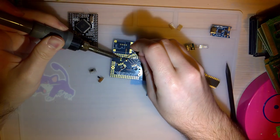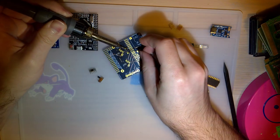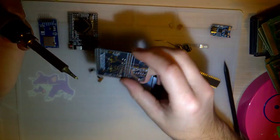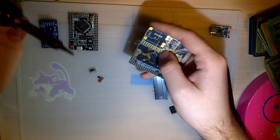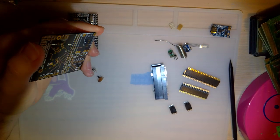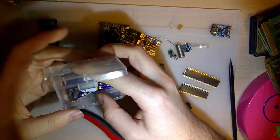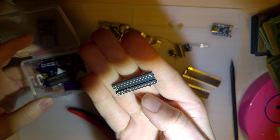And this is my first time soldering one of these after dark boards. This board is of course from Oshpark, and one of the things, I'm sure I've talked about this before, but screw it, I'll mention it again. One of the reasons why Oshpark boards are so cheap in particular is because when they make boards, they're not just making your one single board. They're making a whole stack of boards all next to each other and lined up. So what happens is the boards end up getting panelized. And what that means is they're connected with these little tabs here that you can see by my thumbnail.